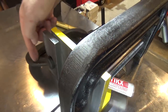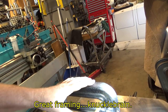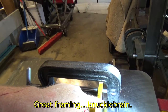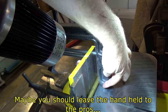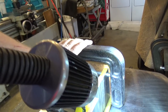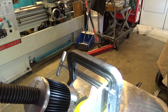Maybe I'll make an adapter piece to fit on here and that'll solve my problem. In the meantime, we're going to go with the old good-old-fashioned piece of steel and a C-clamp, and we're going to cut some brass stock. We're going to cut this first piece off, measure it, make sure it's what I want, and then cut a couple more. Although you'll notice there's not much clamping length left — it's a nice flat surface now, which is a definite improvement. I will have to put a piece of metal to extend the clamp force out farther. This isn't very dangerous material, though round material wants to spin out of your hand when the blade grabs it.